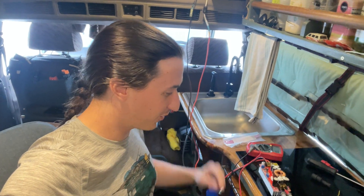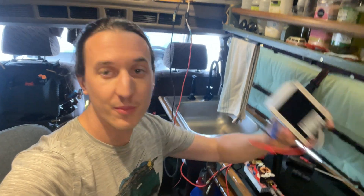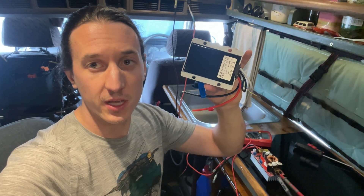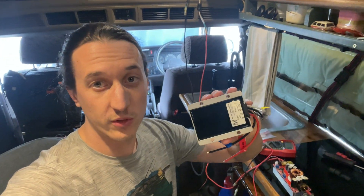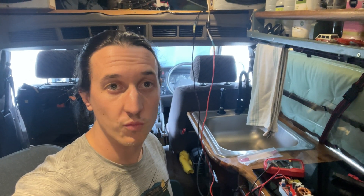I've been to four electrical supply places and called a handful more. Maybe if I was in Seattle I'd have some success, but honestly I don't think so. Short of setting up a mailing address to get a higher quality power supply, I think I'm just going to be stuck with what I have. I've got seven power supplies in the van right now, and before I return all these, I'm going to try to cobble something together. I bought this 24-volt to 48-volt converter on accident — I figure I can use it to step up 12 to 24 and then 24 to 48, and maybe by making two steps we'll eliminate the noise. If this doesn't work, I'm just going to slap a power supply in there and hope we don't have any more issues.